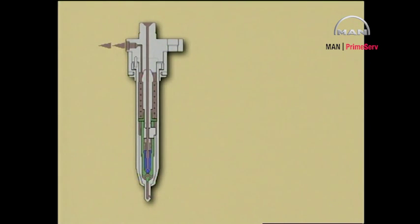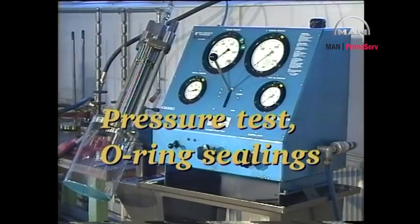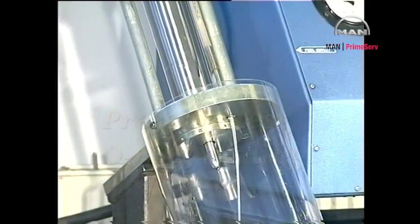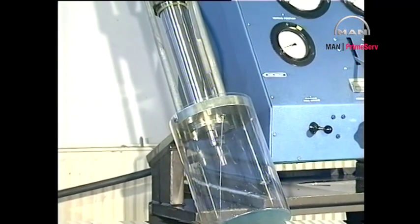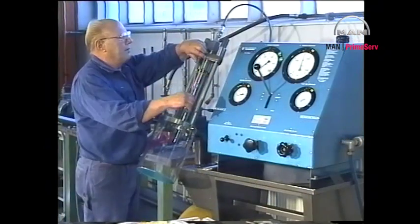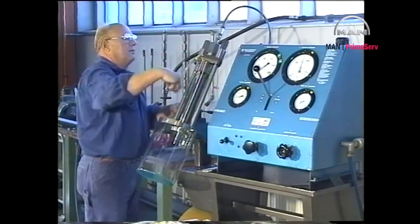If the quick pressure drop cannot be registered, the slide is sticking or the hole is blocked. Disassemble and examine the parts, replace if necessary. Slowly fill the valve by pumping at low pressure until oil, without air bubbles, flows from the return oil pipe. Remove the return oil pipe and block the outlet hole with a gasket and a plug screw.